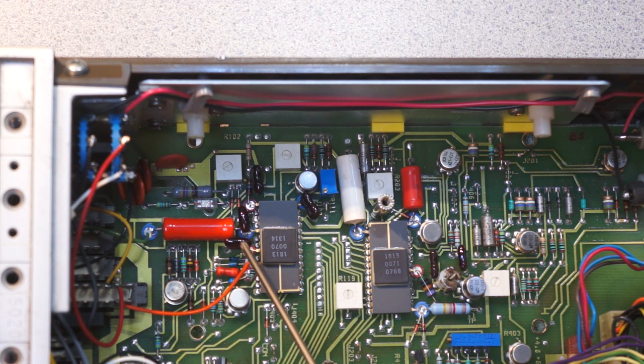So what's happening here is this is like an integrating capacitor, and leakage from these nearby connections would basically pollute the measurement. Sorry, I just got an email. They've actually lifted it up and they're floating it on this little isolated pad. And then here's a big, I think that's probably a resistor. I'm pretty confident it's a resistor. It might be an inductor. And they've got another one.